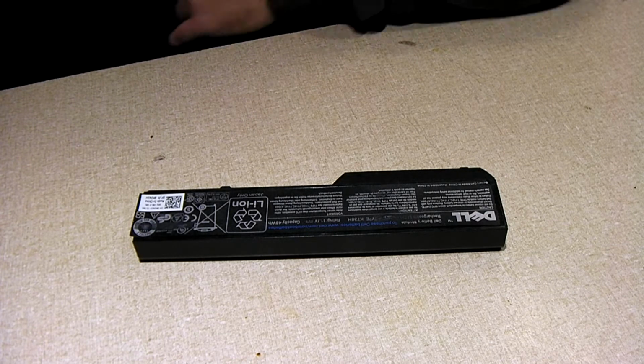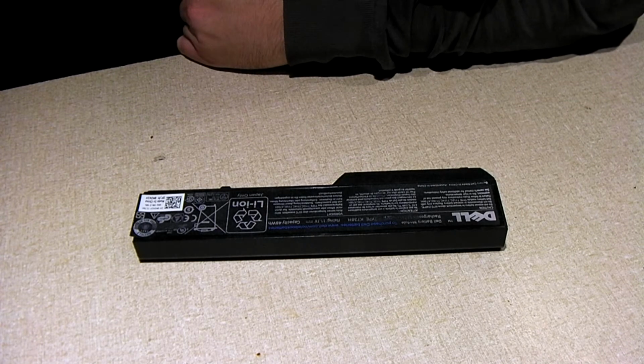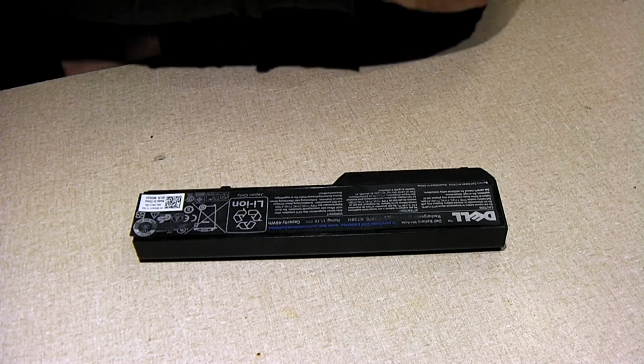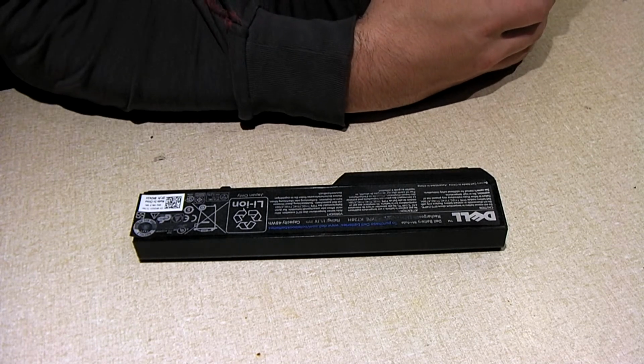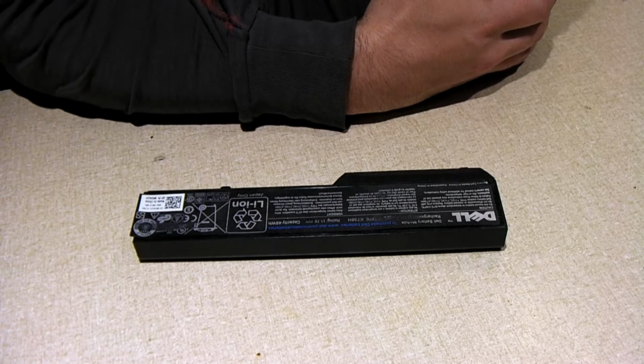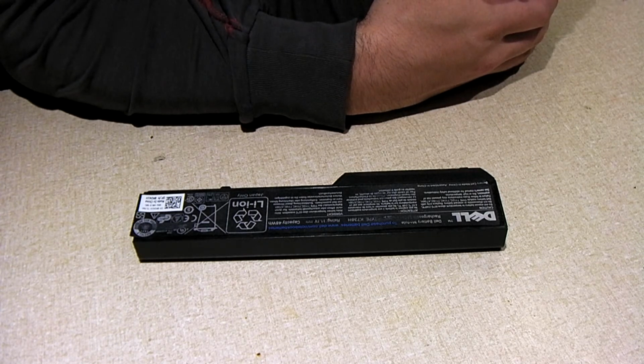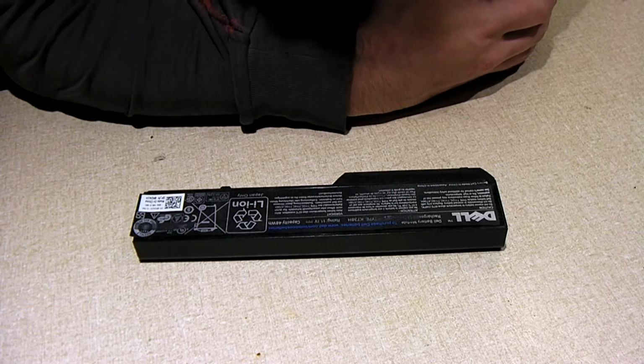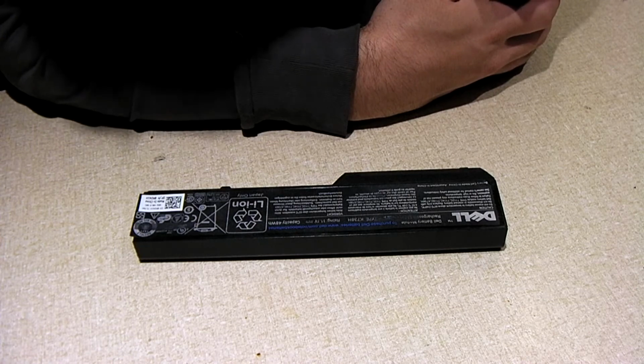Those are probably from 2010, but those are getting worn out. The 1900 milliamp hour cells, for example, they're only charging up to like 1300 milliamp hours now. I've noticed my camera hasn't been running quite as long on a charge, the one I'm filming with right now. And those LG cells, while they're still charging up to about 1800 milliamp hours, their internal resistance is getting quite high, like 300 milliohms. So yeah, they're done. So I decided I'm gonna start cracking up some batteries again.